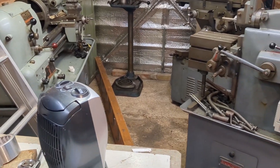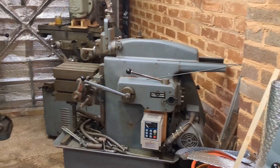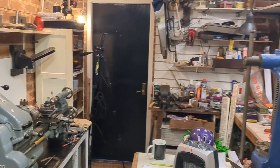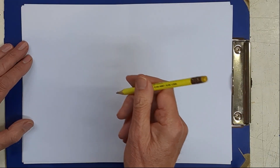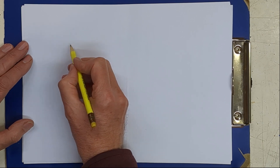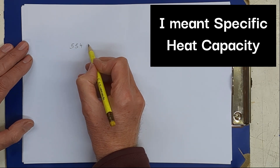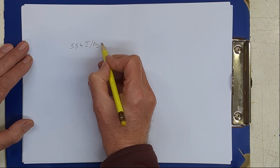Something else I'd like to share: in the workshop I've got a lathe, milling machine, shaper, smaller lathe, pillar drill, and some other equipment. I reckon there's about 2,500 kilograms — roughly two and a half tons — of cast iron in all of that. We can do a little sum to look at how much heat needs to go into the machinery to raise the temperature. The specific heat capacity of cast iron, which is the majority of what my equipment's made of, is about 550 joules per kilogram per degree C.